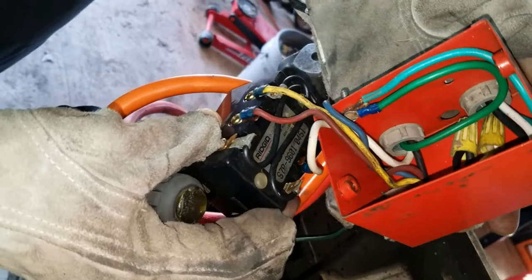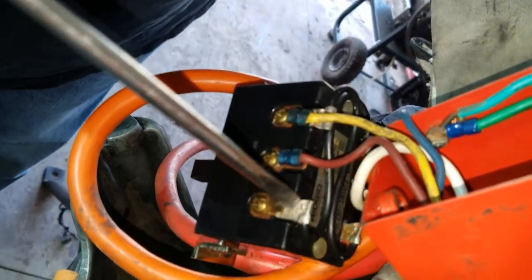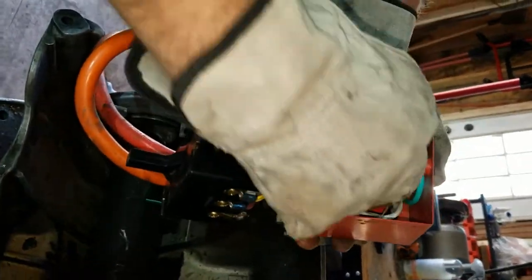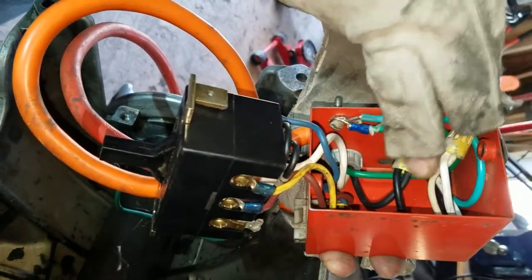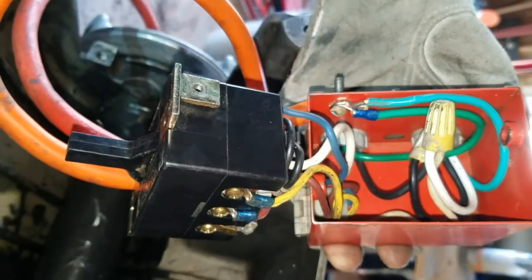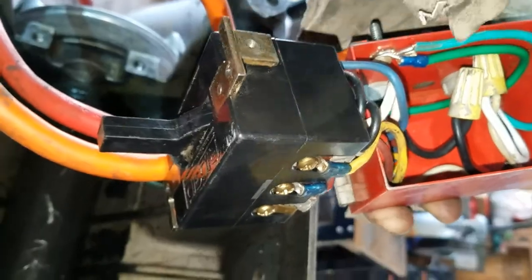There are jumpers on the back of the switch — these black wires right there. That one on the corner swirls around and connects here, and there's another jumper that swirls around and connects to this back post. In that box, the white wire from the power cable splices straight through to the white wire going to the motor — it's a neutral connection for the motor, so it doesn't go through any switches. When we make this connection, I folded the wires in the corner to follow the contours of the box so they'll be very compressed and out of the way of everything else.